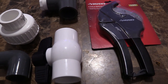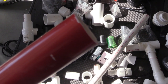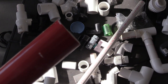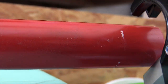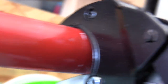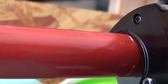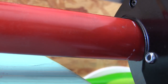Now unions — you guys should be using unions. Another quick tip: don't get PVC and spray paint it red like I did. It's just going to be a pain in the butt. Go ahead and buy the hard PVC that already comes in the color that you want, because that way you won't have to worry about scratches and it'll actually be sealed to the PVC itself and not to the paint. Stop being cheap like me and go ahead and buy yourself some color PVC for your plumbing.